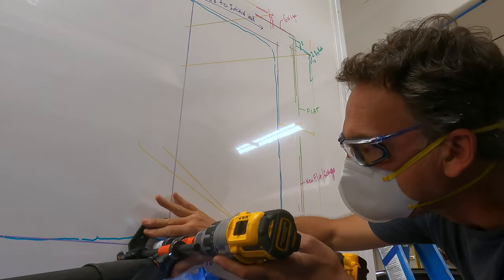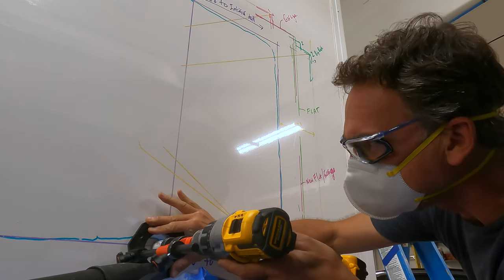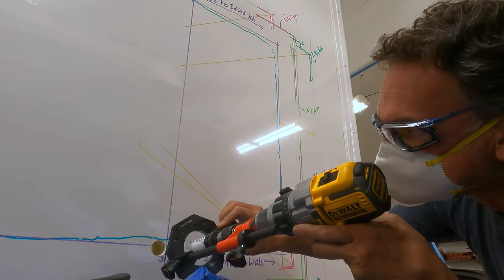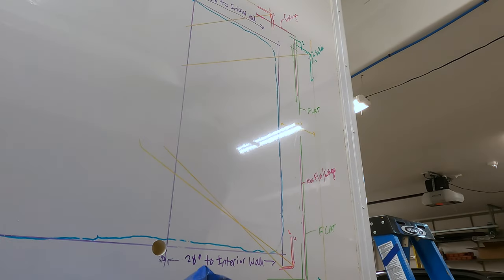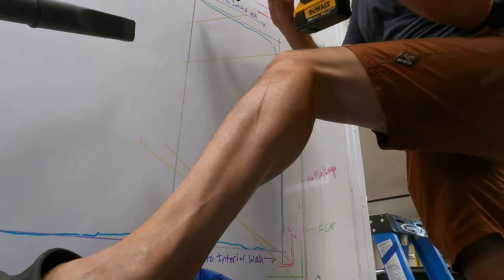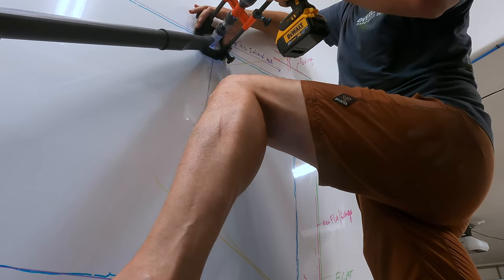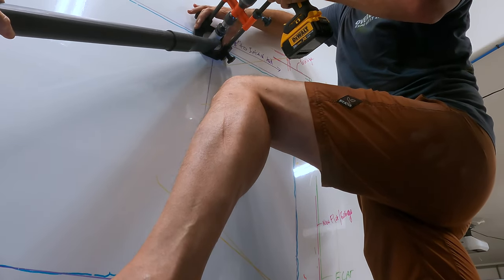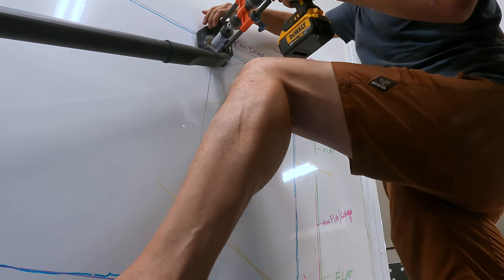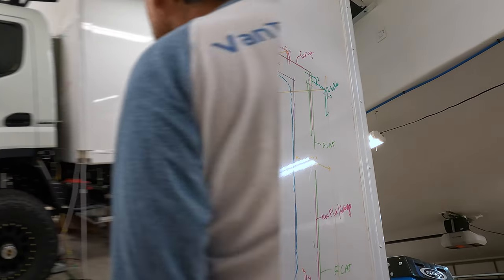And it's really key that these holes get drilled perfectly perpendicular to the wall panel and also in exactly the same spot, both the inside and the outside, because I have to drill these holes from both the outside of the wall and the inside of the wall using those same first holes that I use as my hole saw drill guides in those corners. And you'll notice also, once again, that these holes may not look like they're perfectly lined up with the lines that are marked for where the cuts will be. And that is specific and that is right in order to make sure, again, that everything lines up right and there is cavity for strain relief and also for the trim panels to get into. And you'll see that in a little more coming up.